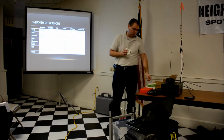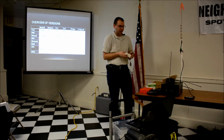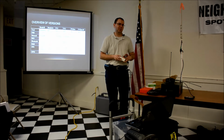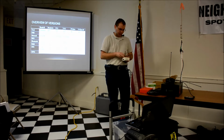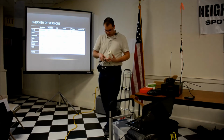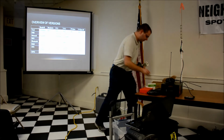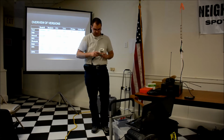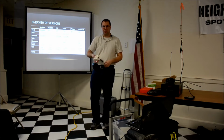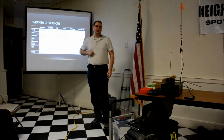I was using it to control one of my first projects with Echolink. The box over here is a combined Echolink radio and an APRS iGate receiver, both running on one Raspberry Pi inside the case. I can pass this around if you want to look at it. It's got a little Altoids tin box with the little controller to go from the serial to the push-to-talk and carrier-operated squelch, and you can sort of see through the vent holes the Raspberry Pi, so I can pass that around.